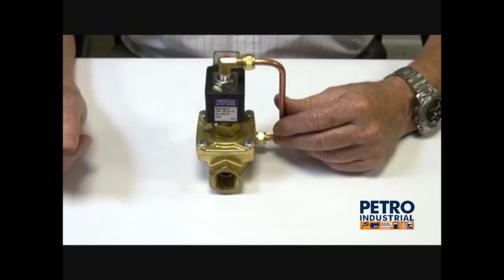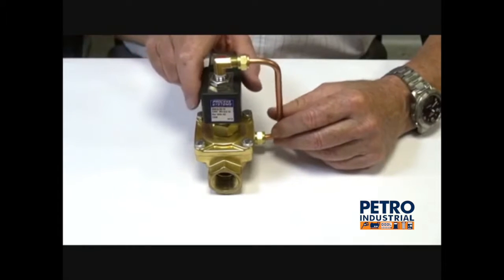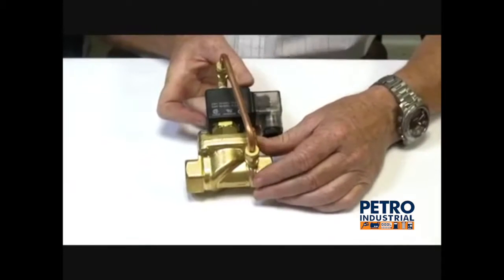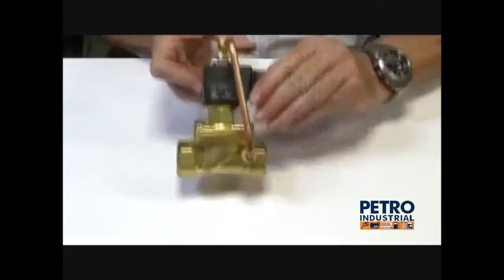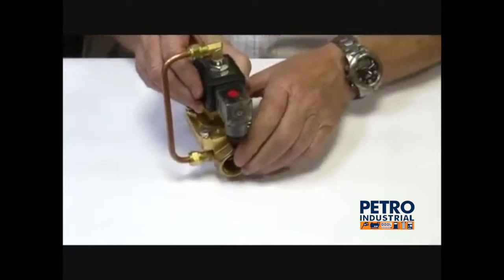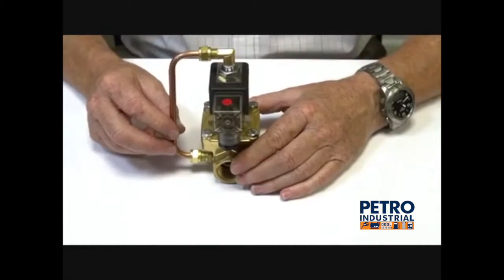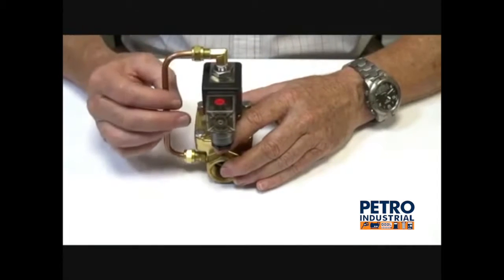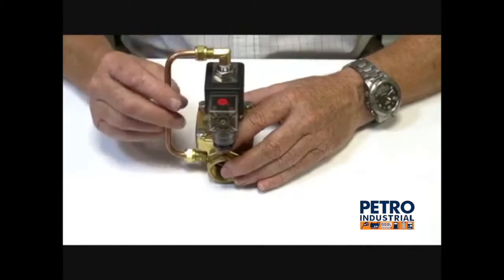Series B56 differential valve. These valves are available in sizes from half inch BSP to two inch BSP. They are a normally open valve with a 0.5 to 10 bar pressure range. Suitable for petrochemical and other applications including hot water, standard with VITON seats. The IP65 coil and IP65 connector plug has an LED, so when you put the power on it lights up.